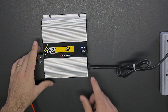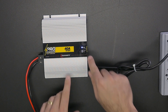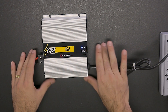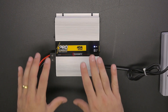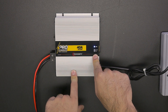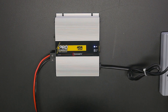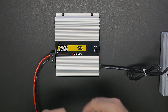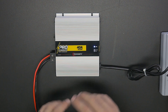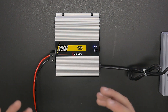The power supply is on. For starters, the on LED is the indicator, and it has two more LEDs. The full LED indicates that the power supply is supplying current at the output. Since the power supply is not doing this right now, the LED is off. It'll turn on as soon as it starts supplying current to indicate it's sending out energy — whether to charge batteries, to power 12V equipment such as amplifiers, audio processors, among others. In home speaker boxes or even when using it to keep your sound system running, it'll require current from the power supply, so the full LED will be turned on as well.